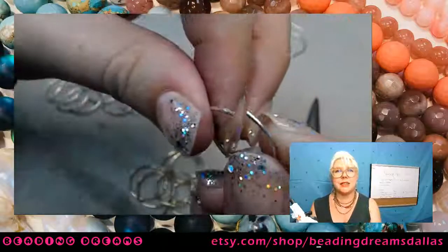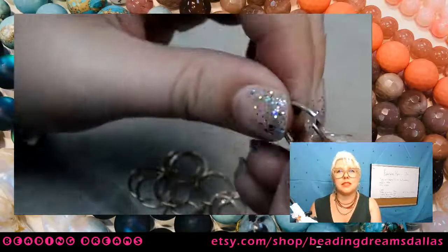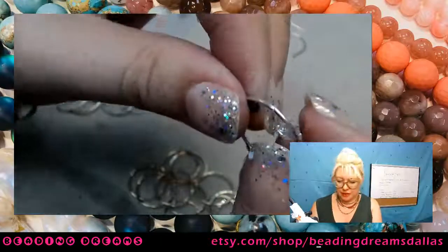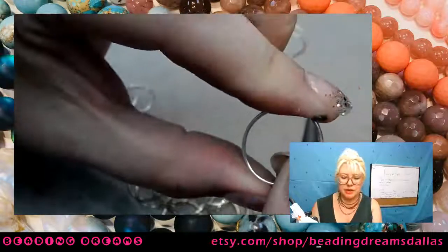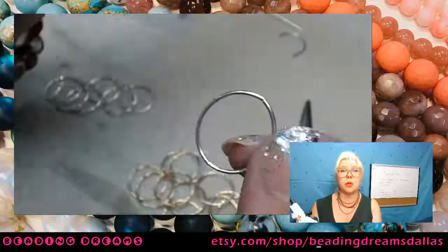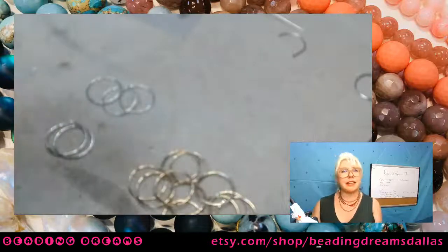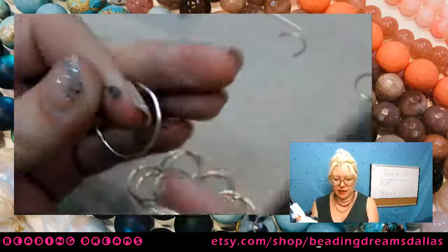And then I'm going to tension fit my circles. So to tension fit, I'm just going to move the ends past each other and then bring them back so that they snap against each other. Basically what's happening now is my ends are holding together with tension without me having to actually hold them. And it's not a complete circle anymore, and that's totally fine. So now we're just going to speed file and tension fit all of these links.